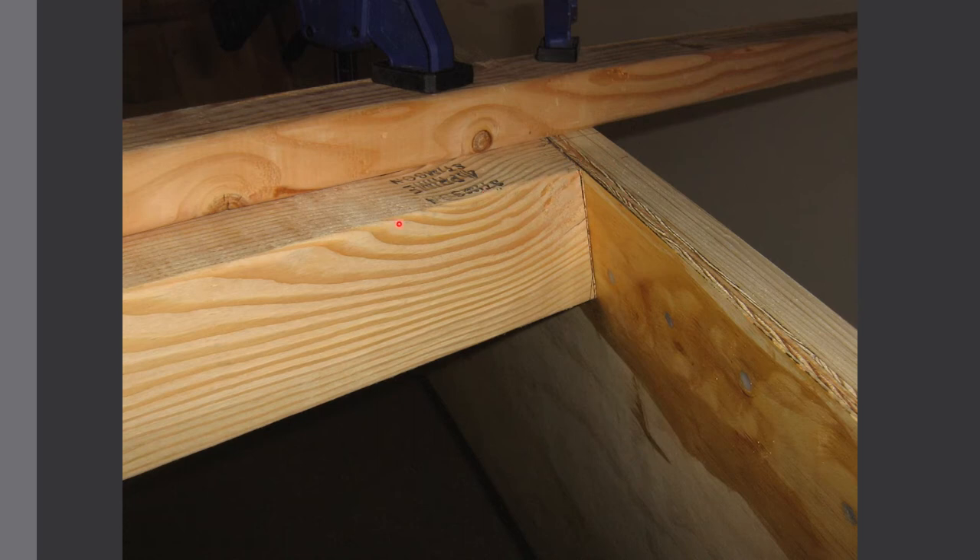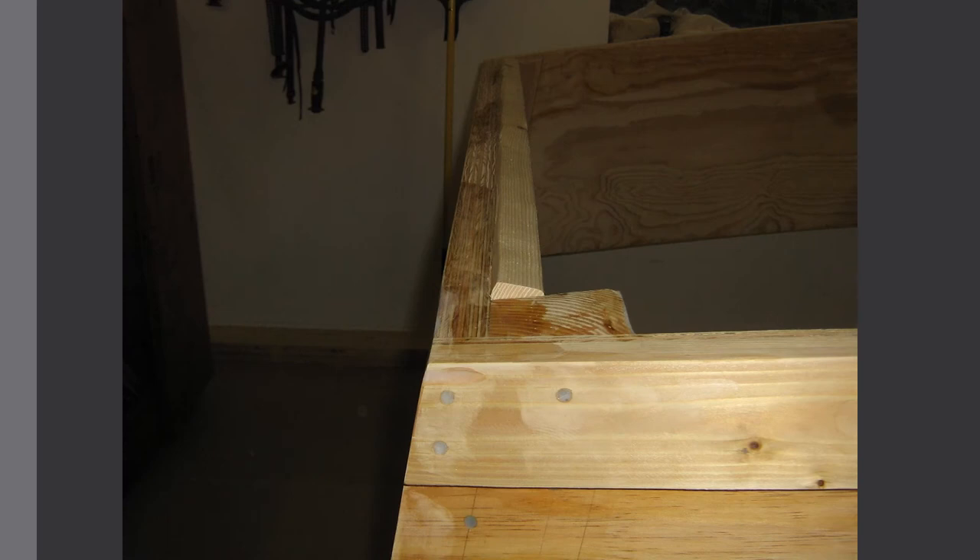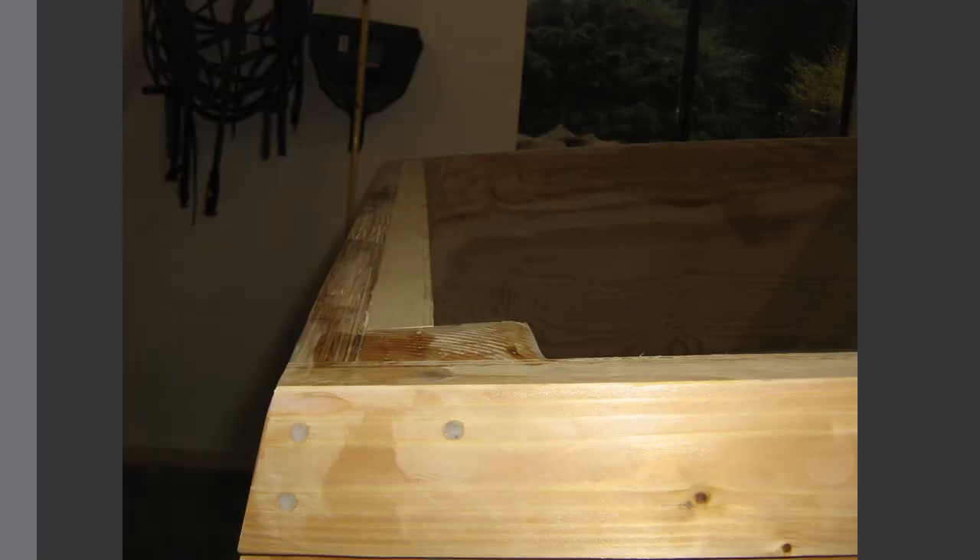I attach the frames to the sides with four 3-inch deck screws through each end, through the chine, through the plywood, and into the posts. The bottom timbers for the mid frame and aft frame are very similar. Along the transom, I installed a 2x4 between our vertical stern posts — we'll attach the bottom plywood to this 2x4 instead of screwing into end grain. Now was the time to plane this corner down flush with the surrounding timbers, which I did with a freshly sharpened block plane. Voilà — nice and flush.